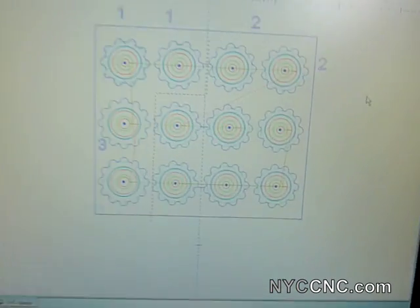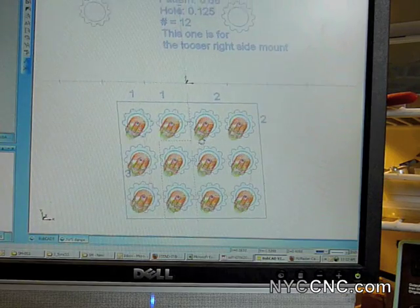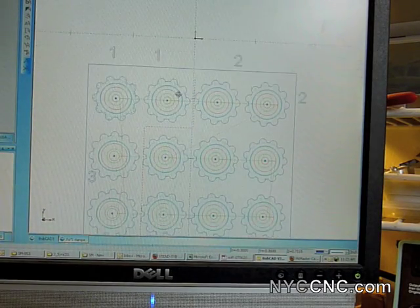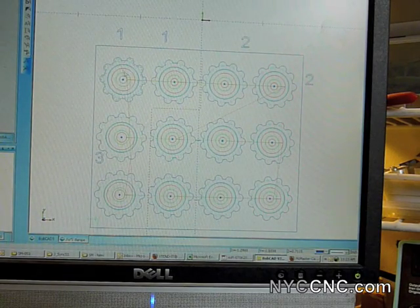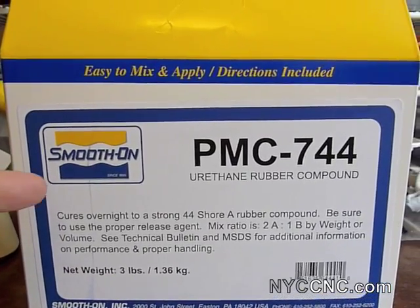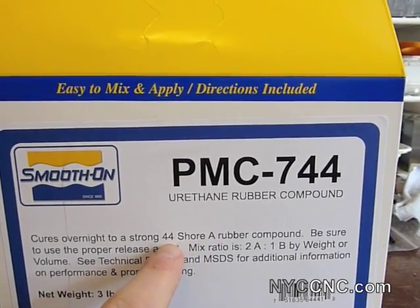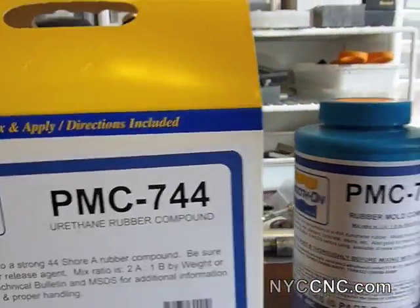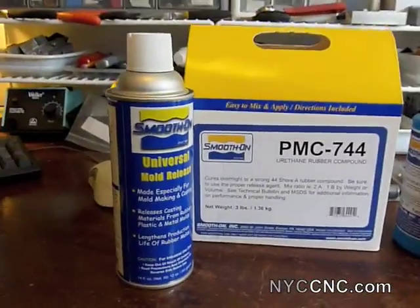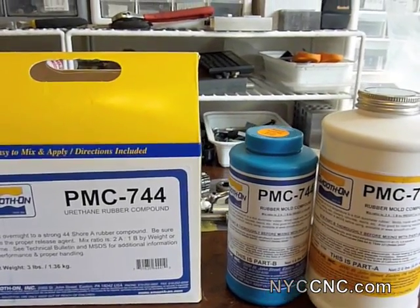What I'm doing today is I've got this piece modeled up in Bobcad, and I've got a grid of 12 little sample molds that I'm going to mill out — you'll see later in the video exactly how I'm going to do that. The idea is to mill them out, place a little plug in the center, and then use this urethane rubber compound I bought from Smooth-On called PMC 744, which is supposed to cure to a Shore A 44, which should be perfect. I bought their little sample kit, which with the requisite mold release agent was about 50 bucks delivered, and it's clearly going to make significantly more than I need right now.